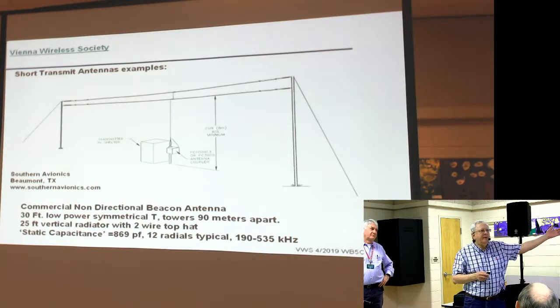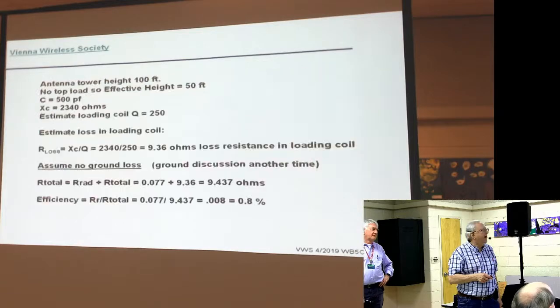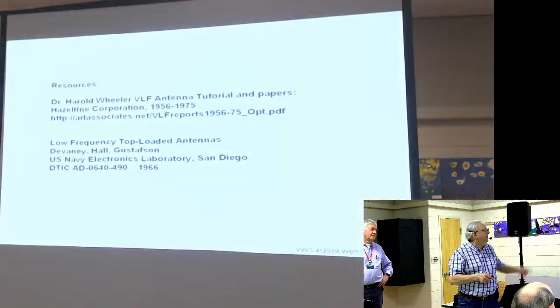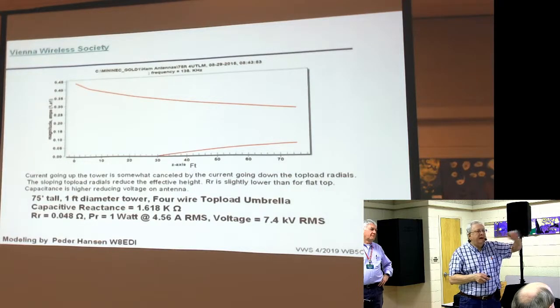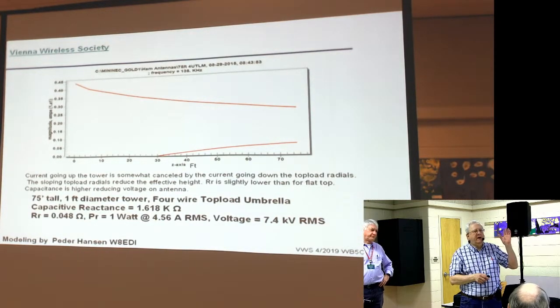Yes, that's a good way to do it, to have a low impedance driver. I don't remember exactly, but I think I was told that the WWVB transmitter is that way. It's a solid state transmitter with a very low output impedance driving the line going out. Now they actually use transmission line out to those WWVB antennas, but it's the classic problem. If you have the transmitter a long way from the antennas, you somehow have to get the power out there.